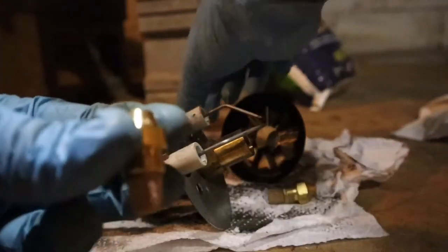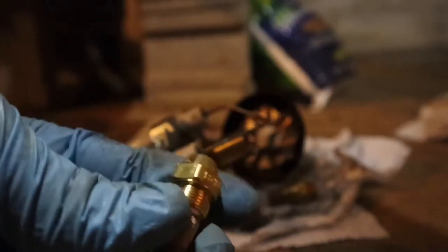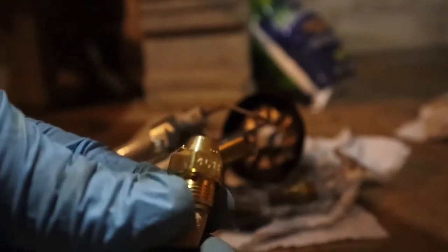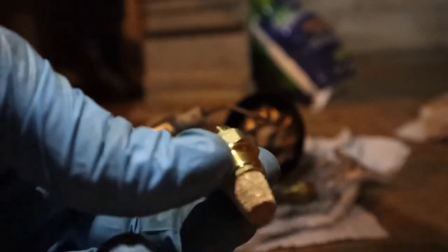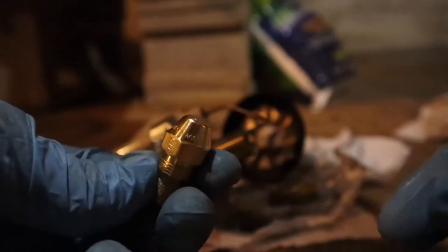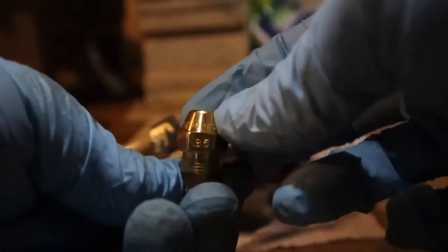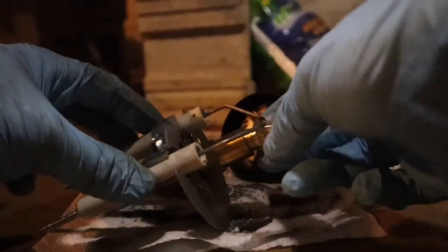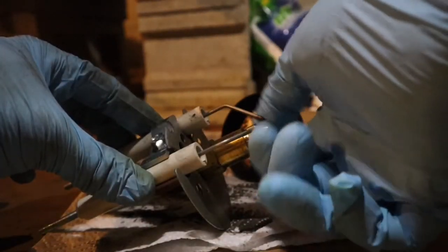The blue cap does mean something — it refers to whether it's a solid cone, hollow cone, or an atomization pattern which is a bunch of fine droplets. The blue does signify something. But you can see right here: 45 and then 0.85 — same specs as the original.